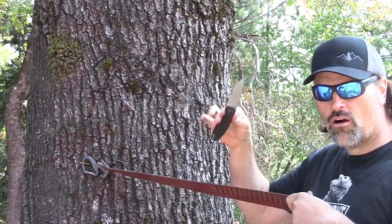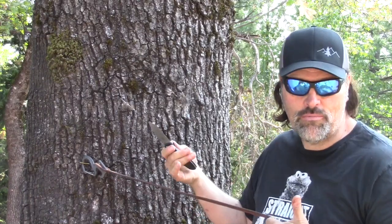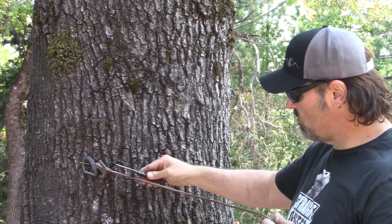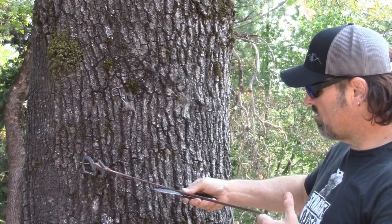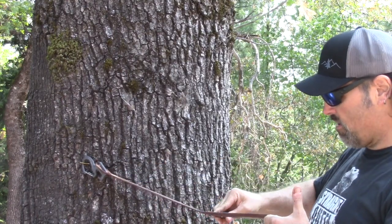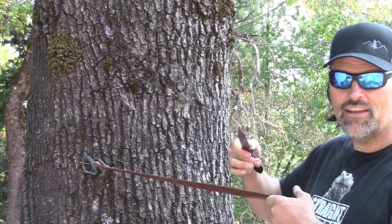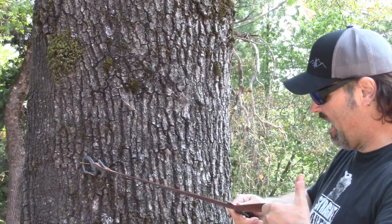This would be a blade that we've already gotten fairly sharp on a diamond hone or whatever you like to use — for me, one of those Lansky sharpeners I just showed you. Take your blade and you just want to draw it away from the edge. Keep alternating like that. You don't have to bear down on it real hard, just draw it across here — you're polishing that edge. Make sure you don't hit your hand. You just keep drawing it across there and that is going to put a very high polish on that blade. It is going to get very, very sharp very quickly.